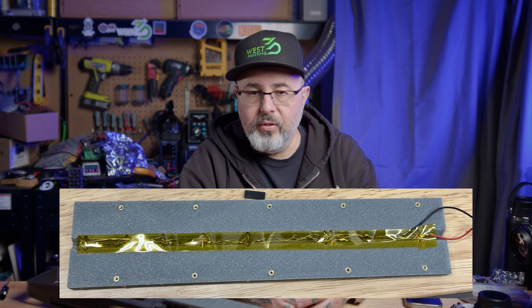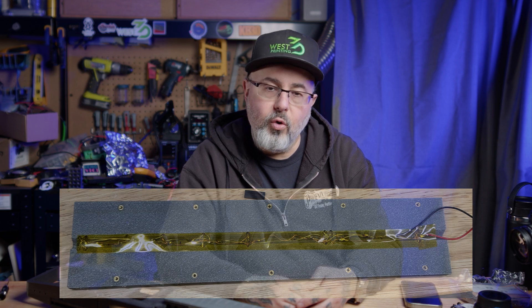What I found worked best was to do one LED at a time. Every time I made another joint, I would test using my bench power supply set to three volts — you could also rig up a battery holder. Test all the LEDs at every step of the way, because there were a number of times where soldering in another LED would dislodge a previous joint I thought was fully soldered but wasn't. The solder can grip onto the lacquer before melting through, so just be methodical. I also put a strip of Kapton tape underneath to make sure no solder joints could short against the aluminum rail.